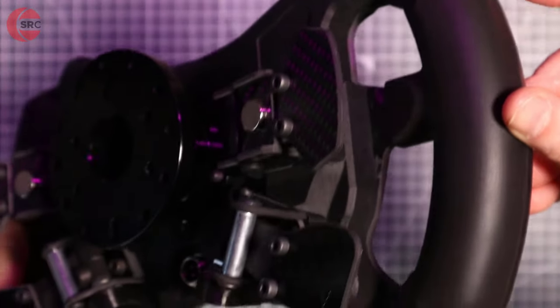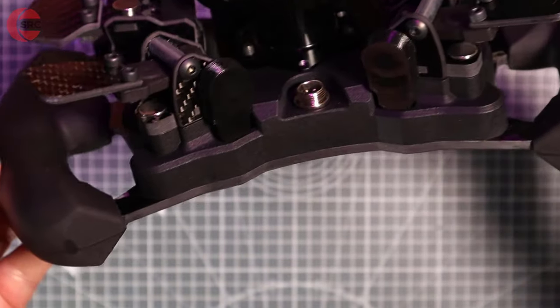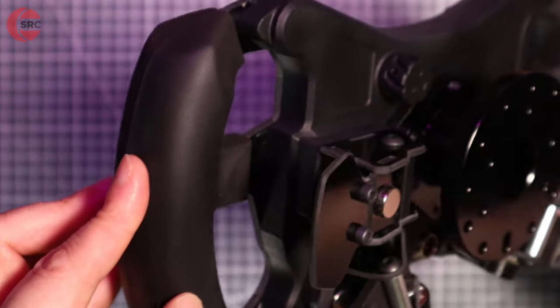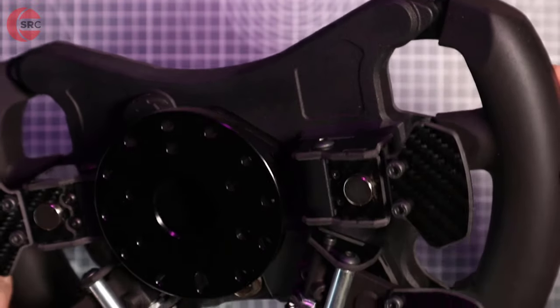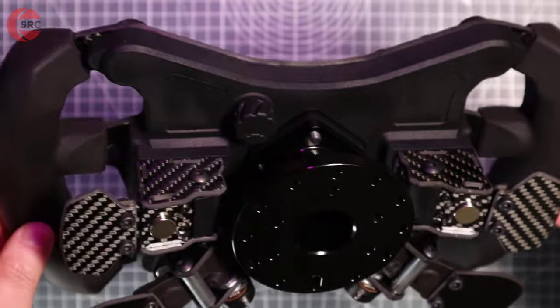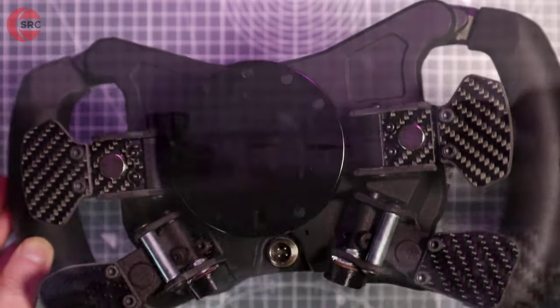The enclosure and other parts of the steering wheel are made from hard-wearing nylon using Jet Fusion, an advanced industrial 3D printing process where objects are fused from a special powder. Unlike traditional 3D printing, there are no visible layers, instead leaving behind a consistent textured matte surface.